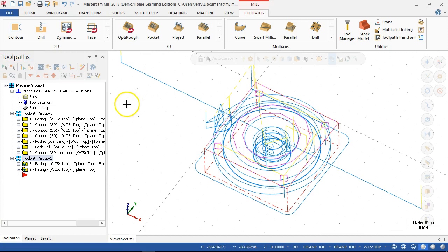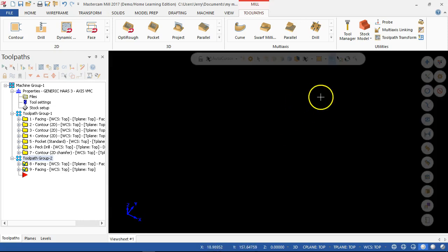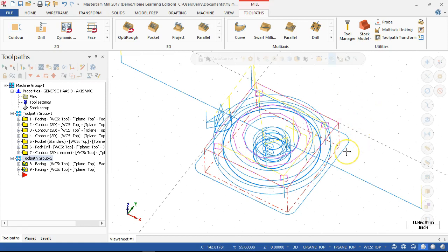No. Two programs. If we had two vises, I could have this program in one vise, set a different work coordinate, flip it over into the other vise, machine it off. Typically, we're going to accumulate however many parts we're going to accumulate, and then do the second operation either on another machine or as a second setup in the same machine.